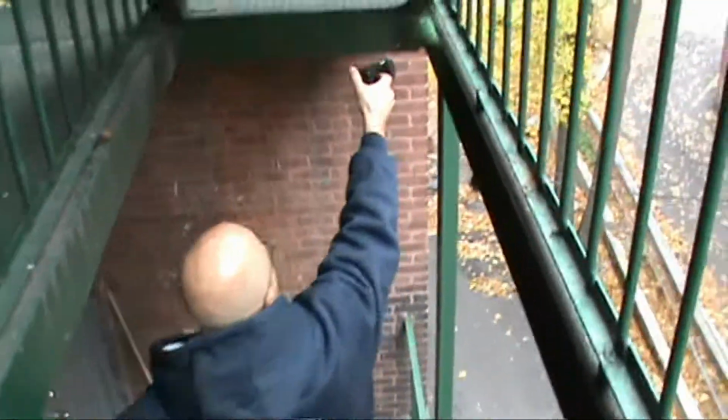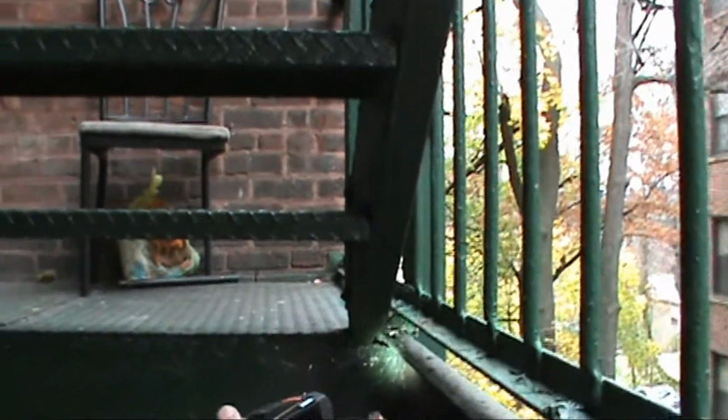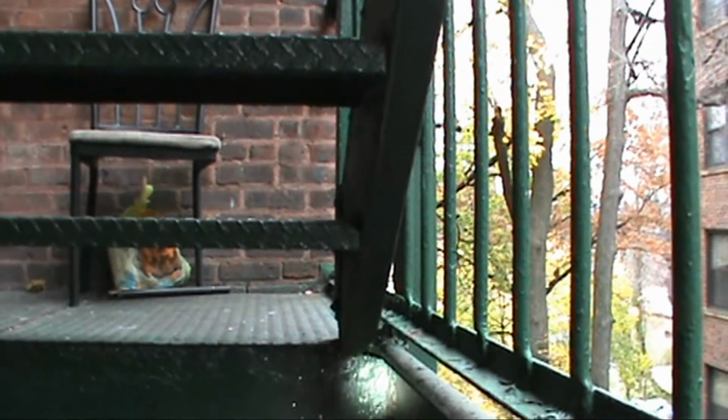If you can get in there and see that, you see that? See how much rust is in there? All that needs to be cleaned out. This whole area needs to be rebuilt and reinforced as necessary. And if you come on this side, you can see just how bad it is from the outside here, Inspector Elise. See how much work there is? So this is not just rebuilt. This area needs to be reinforced a little bit, a little sistering of some additional steel because it ate too much. This looks like it's 3/8 thick, and you've probably eaten at least 30 to 40% of the integrity of the steel, so that's not acceptable.